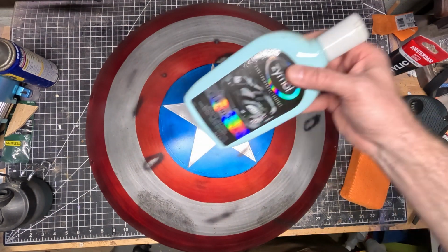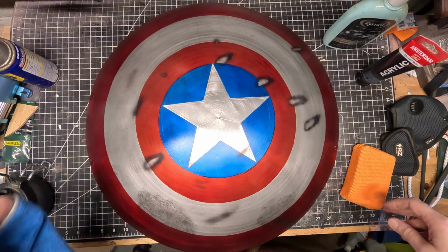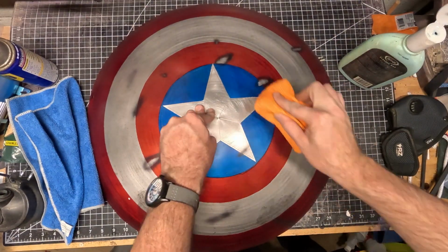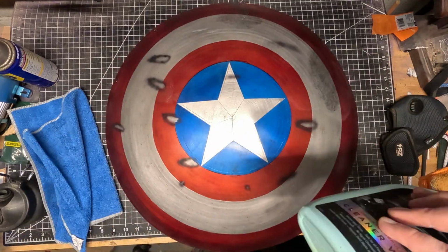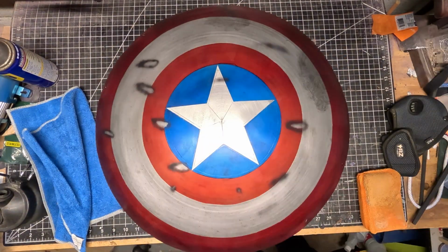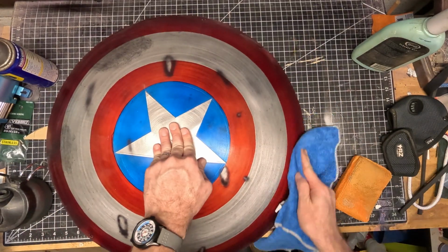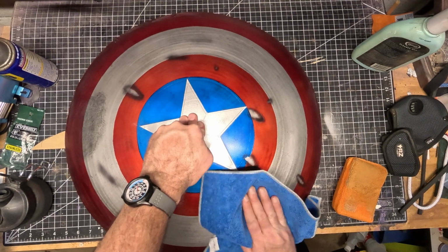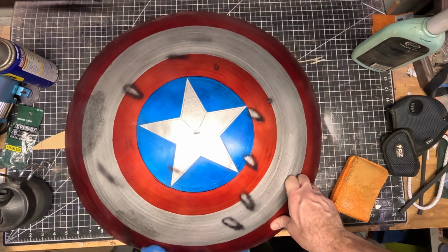We're going to do that with basically car wax. This is cleaning wax in this case, which again helps with the little micro scratches and such. And when I said we're treating this just like a car finish, we are using car wax, car applicators, and microfiber towels. So you can see the part with wax versus the part where the wax is still on it, and you can see it is noticeably, not necessarily shiny, but glossy. It has that depth to it.